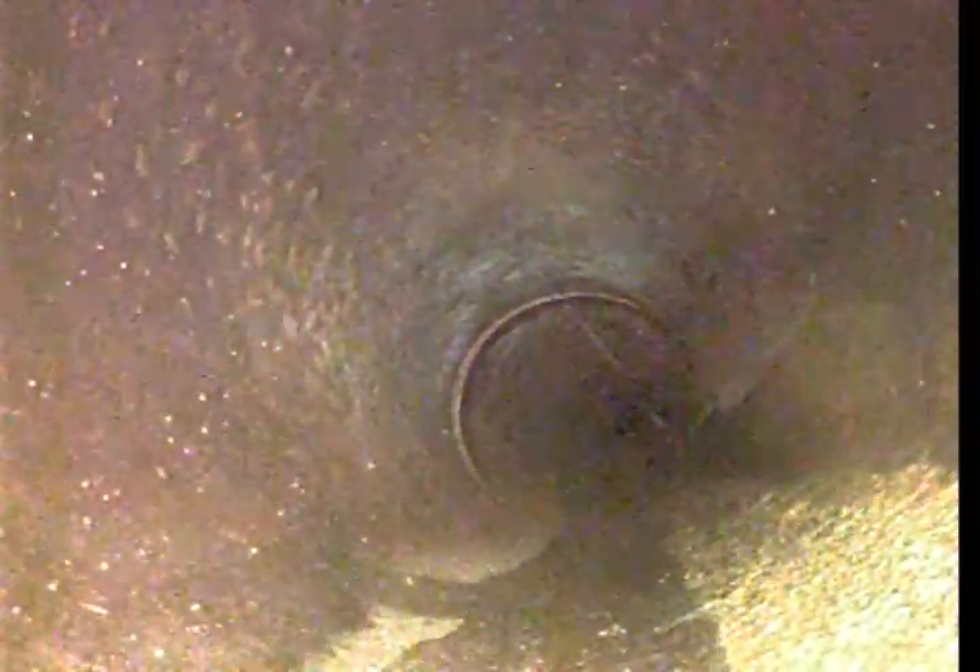Sometimes when we see a glare I can't really see everything well, but when I get it to a computer I can see it really well. Right now we're recording — we're 96 feet in, right where that black dot was in the middle of the street. You can see that the line looks open and clear, but I can't see it 10 feet down the last seam, which is the most important part.